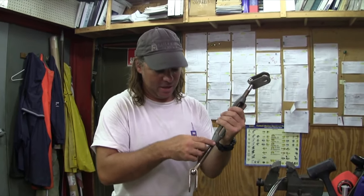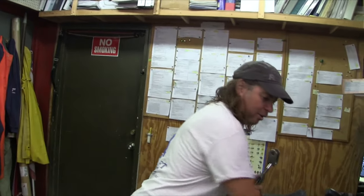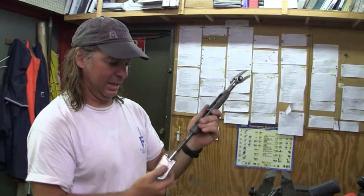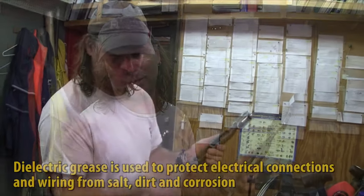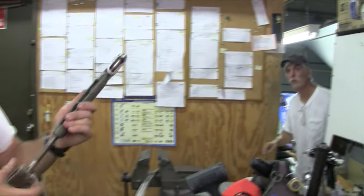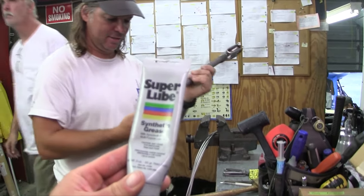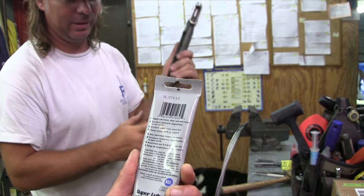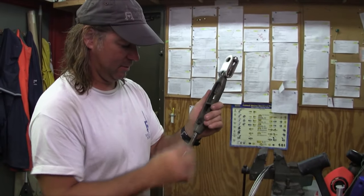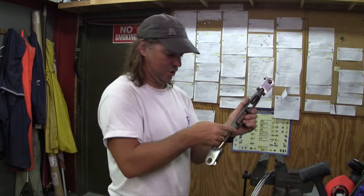This also makes an excellent winch grease if you don't have the actual winch grease. Harken, Lewmar — all these winch companies make their own greases, usually some sort of calcium-based waterproof grease. Super Lube will do the same thing. You can also use it to lube the gears on your windlass. So if you don't want to have all these different products aboard, this one does a lot of different things — it can also be used as a dielectric grease. Put a little smear on the bottom of a light bulb socket and running lights, anywhere you want to prevent corrosion. Still prefer the actual winch grease made by the manufacturer, since it's specifically formulated for the slow-spinning, high-pressure gears — but any port in a storm, Super Lube is completely acceptable.